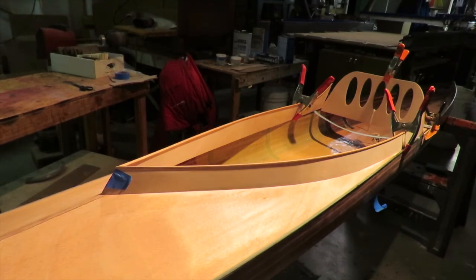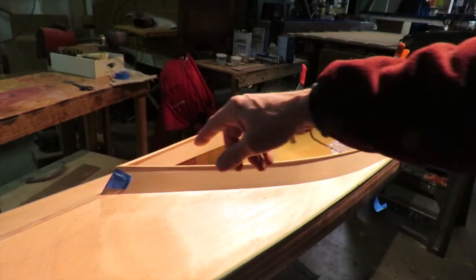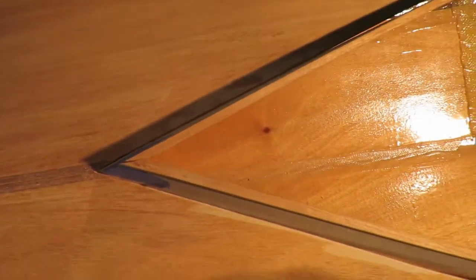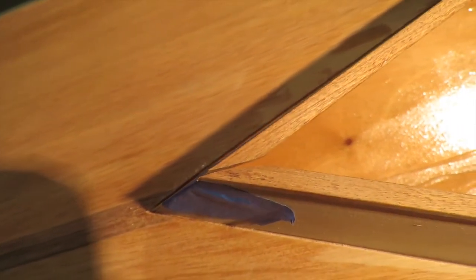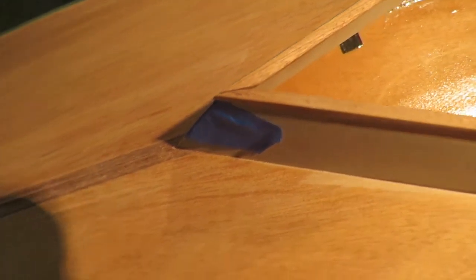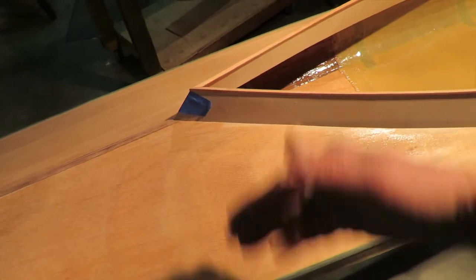It's a little fiddly - if you have an extra hand at this point that's great, but you don't really need one. It's just going to slip around a little until you get it firmed in place. The tape across the front is important. But before the tape, we beveled the two front pieces where they come together. Using the bevel gauge and protractor, those angles on each side are beveled at 22 degrees. You don't want to change the angle of the front where it slopes - that angle is set correctly. Beveling the inside edges so they meet together nicely is an important step.